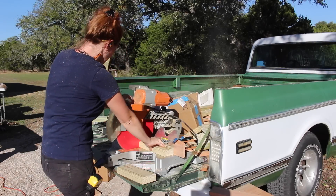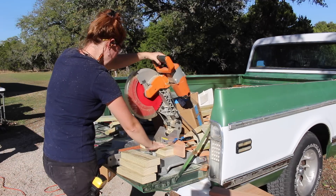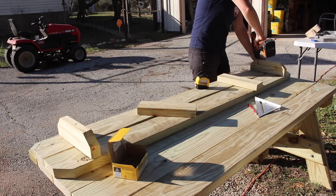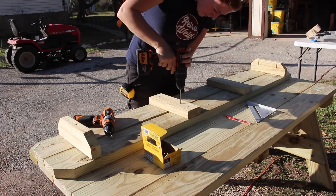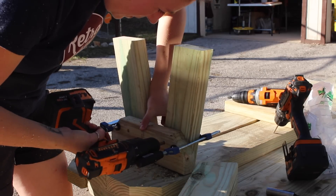I know I said I was going to build a traditional style picnic table, but I decided to make removable benches instead of attached benches — I personally find it easier to be able to scoot the bench out, sit down, and then scoot it back in. The benches are very simple, pretty much a direct duplicate of the table but in smaller form, so I cut the top, attached the underside bracing, and then attached the legs again using some carriage bolts.